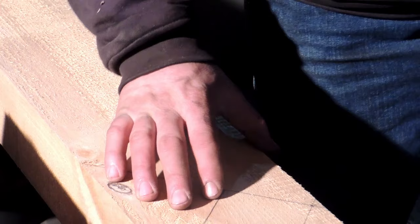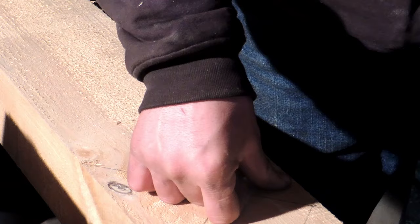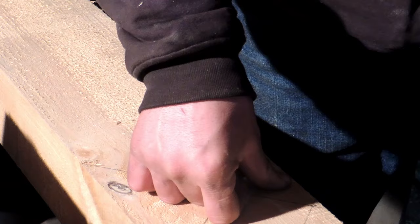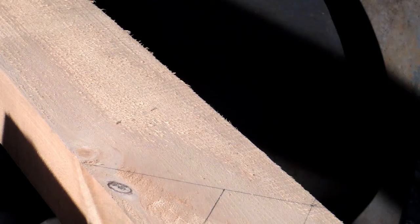This is a standard brace size. A 4x6 is one of the standard ones. You can go 4x4, 4x8 — kind of whatever your heart desires. But don't undersize them. For the size of the beams I'm using, this is probably the smallest brace that I would use. I'm going to lay out the last one I have, and then we will get to cutting them.